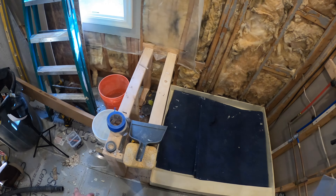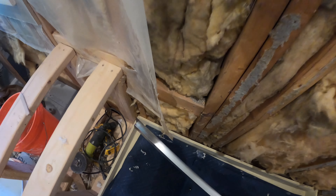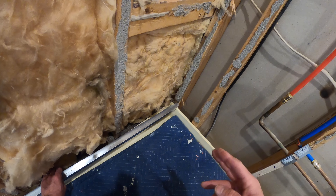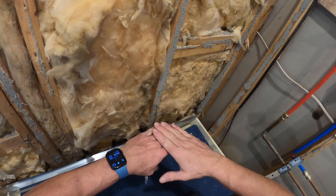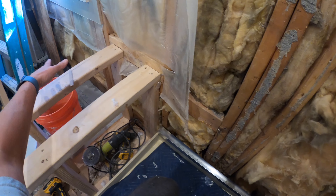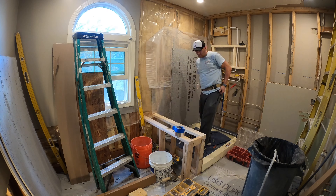That's a wrap for the first part. A few days later — I've prepped the bathroom and added the second wall. The next step is installing the Tile Ready flashing. A lot of people are commenting wondering if you silicone the back. I don't silicone anything on here except for the corners — I'll put a bead of silicone on the corners, cut the flashing and overlap it. Then I'm going to get into how I waterproof the bench area.